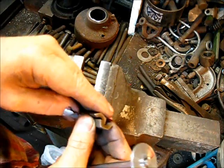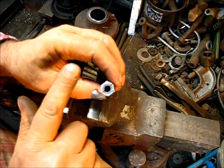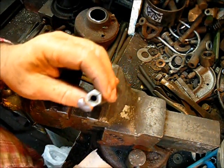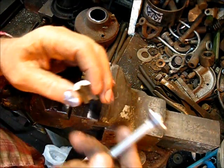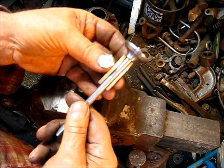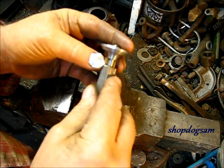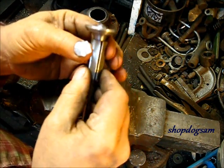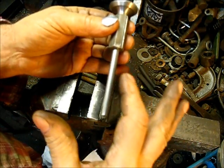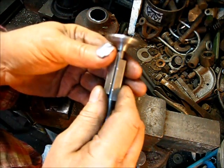Before I sawed it apart, I put it in the lathe and turned one end of it flat in relationship to the side — that's the part that goes toward the valve head. The two matching halves will be just like that right there, and you can see I've got a decent gap in there. It's a five-sixteenths hole, five-sixteenths material, with the saw gap.